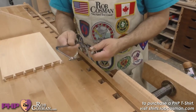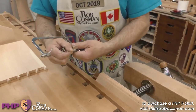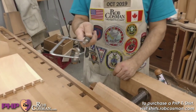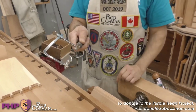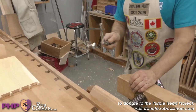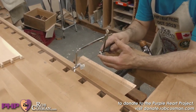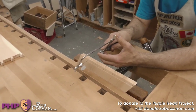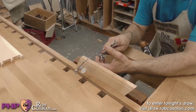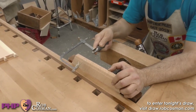And then I take a pair of pliers or needle nose, and I grab the blade right here, and I give it about a 30-degree twist, the same thing up here. Now, when I make a horizontal cut, the frame actually stays up like that so that I'm not limited in the depth of the throat. So that also means that when you drop down here, you have to make sure that you bend it over to get it so that it's laying with the sides parallel to the kerf, and it'll fit down there. Go to the bottom, come up off the bottom, and then just cut away.